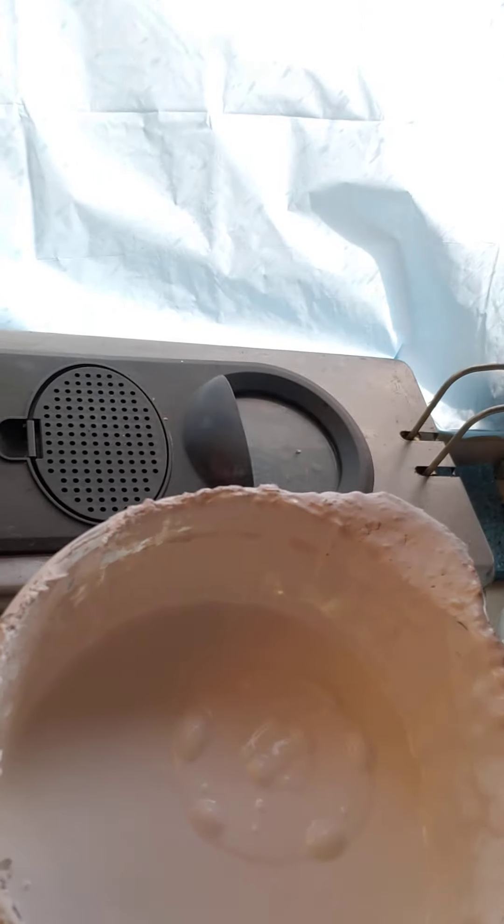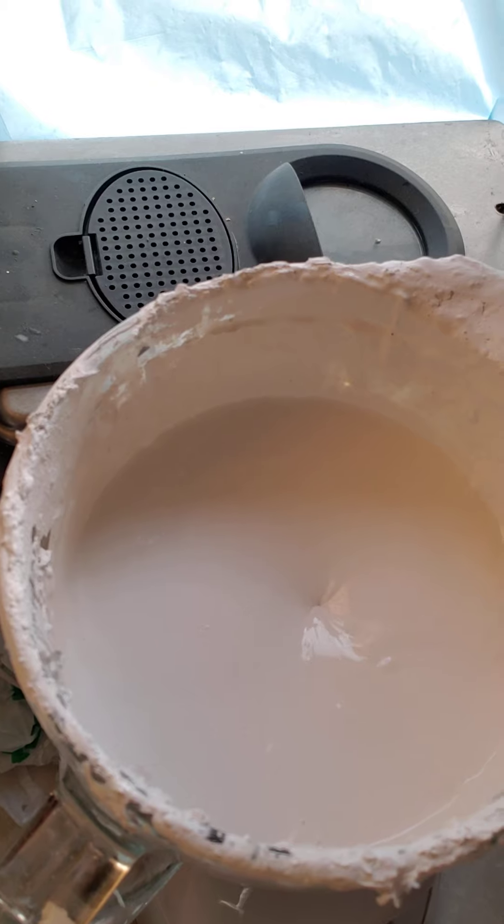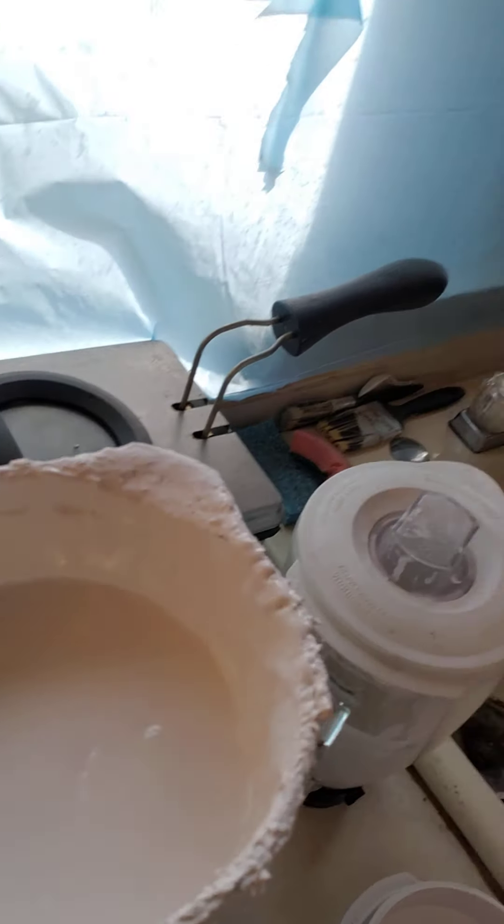Just to keep this process simple, and also if there are defects to the wall as it gets older I won't have to get as many paint buckets, I'm just going to do the top half and the ceiling the same color. I'm not even sure if I need the blender but I'm going to see how it goes. Now that I've mixed it in, it's got a yogurt appearance, and when you see that tornado-like effect it's actually mixed in well. I'm going to pour this back into this bucket and then put it into the big five-gallon container.